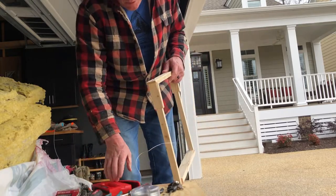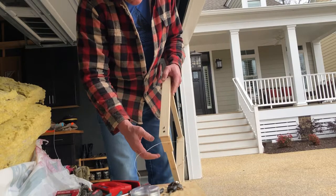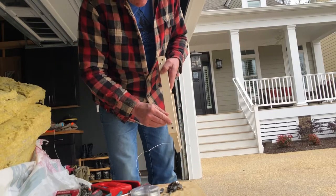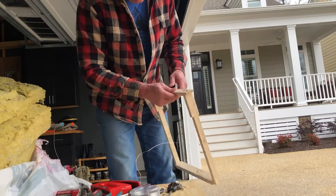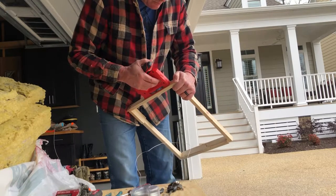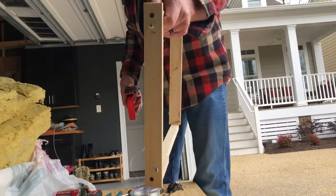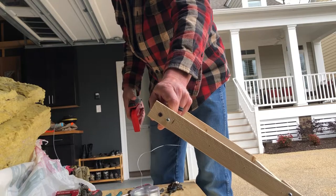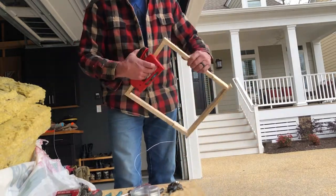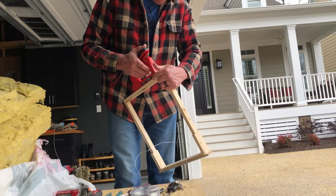And then because the wires are more prone to cut into the wood, you just have to think, okay, we're coming from the screw down into the hole, and then position staples like that. I don't know if you can see that. So that the wire goes over the staple instead of directly onto the wood.